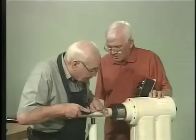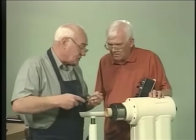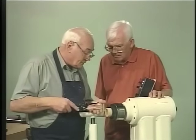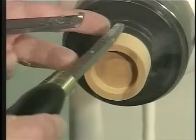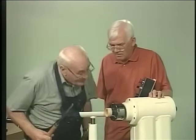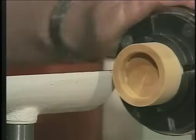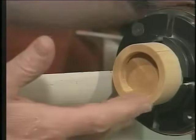And there's our thread cut. It's a full thread. It's nice and clean. Again, see the shaving. We want good shavings like that. If you're just getting dust off your chasing tool, it needs sharpening. And there we have our good, clean, internal thread is cut, ready for matching into our male thread.